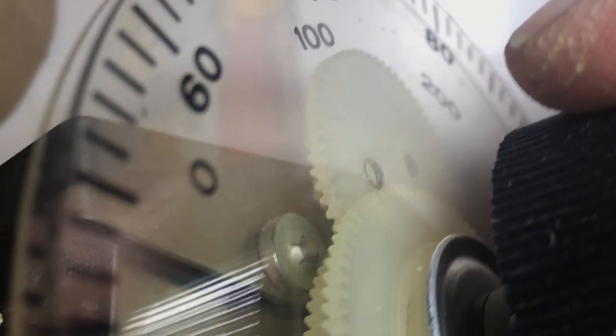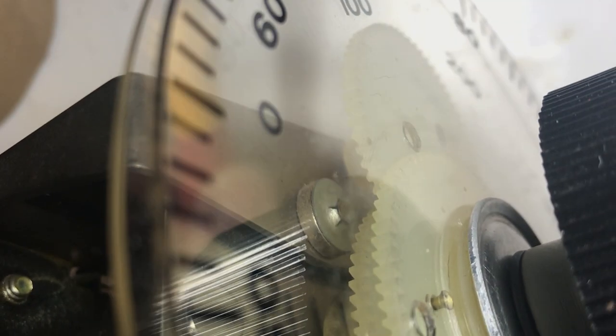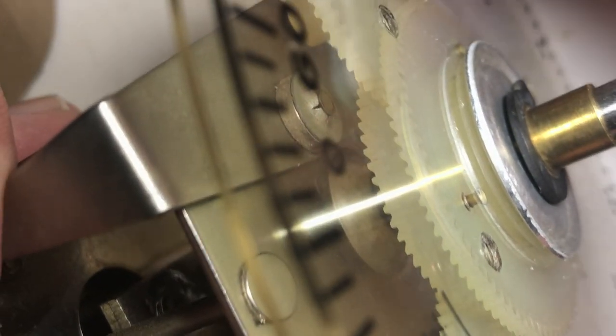Let's spin this way. You can see this thing is buttery smooth — it's perfect. I'm really happy with it. I think this one didn't have much usage but it really turned out nice. We know we're going to come to a stop here. You can see the worm gear inside here — it's going to hit a stop. There's a little stopper ring they put in. That's new — the 4C line has that. The other ones don't, they use a detent in the front.